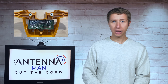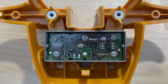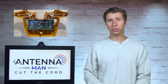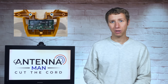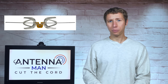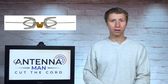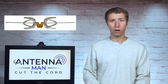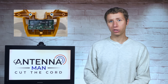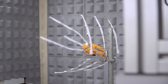The preamp amplifies VHF and UHF independently only by the right amount to avoid overload. The preamp is built directly into the active element on the antenna, amplifying gain right at the source. This is the optimal way to do it, as signals captured by an antenna can sometimes be weak to the point they degrade quickly through coax and connections. By placing the preamp right at the dipole element, Televis antennas are able to take advantage of every fraction of a dB of signal available. A very sturdy and reliable construction is needed to add the preamplifier right into the antenna, which Televis is known for.